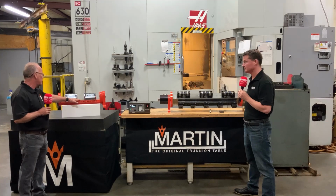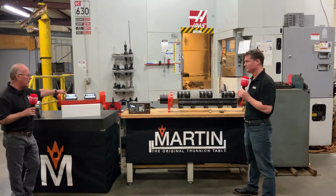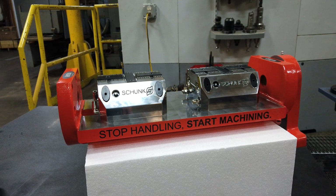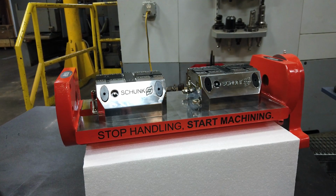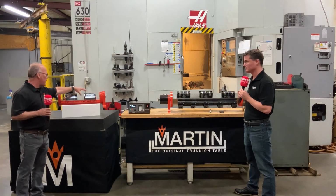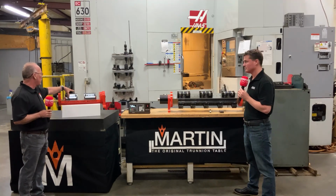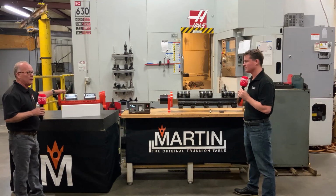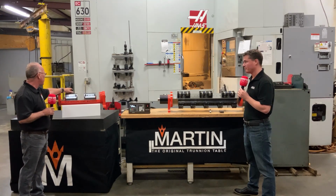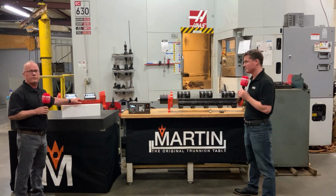This particular fixture, we're showing 2 Schunk KSP 160 vises, which we use a lot. Schunk makes a great product, and it works extremely well with our trunnion tables because, again, stop handling, start machining. You can either manually load these vises with an M code or a switch on the side of it to open and close them, or you can do it robotically. We work with a lot of robotic companies around the country that are using this exact setup to load parts.